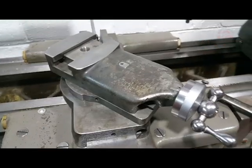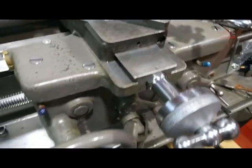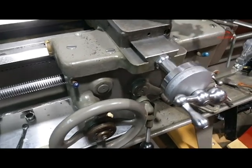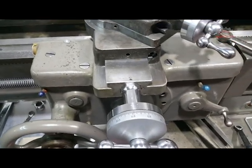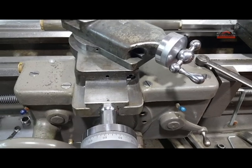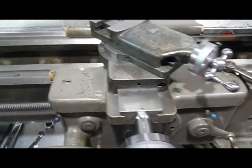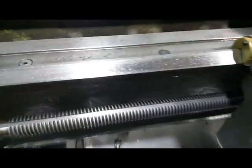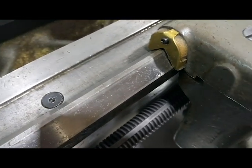I don't like to do things halfway. I had changed the way wipers on it and found a lot of crud underneath the apron, so I was able to clean all that — there were quite a bit of metal chips under there. I recommend you guys do that to your lathe, because that's no way to run a machine like this, especially if you want to stay precise and keep your ways nice. That stuff laying on the ways — it's all oil and, believe it or not, lint from my buffing work.